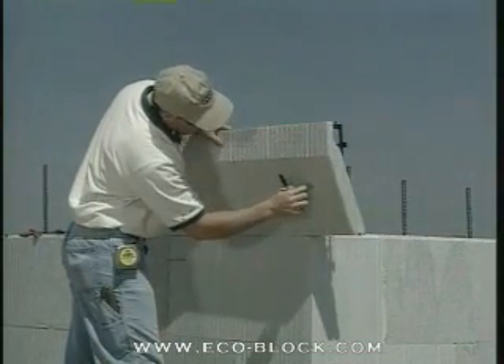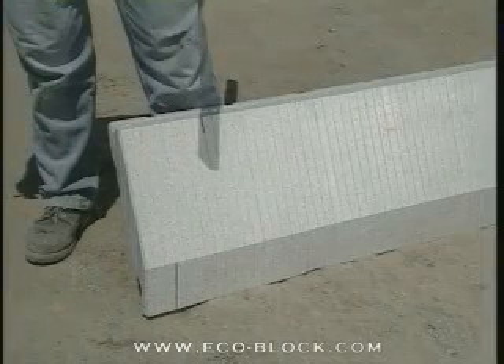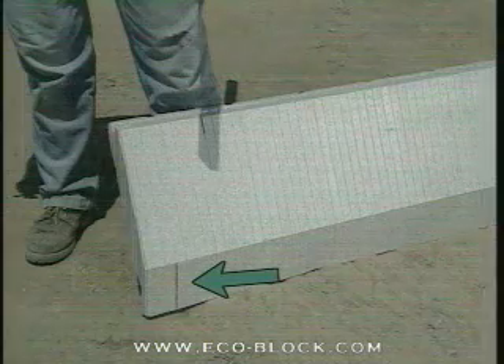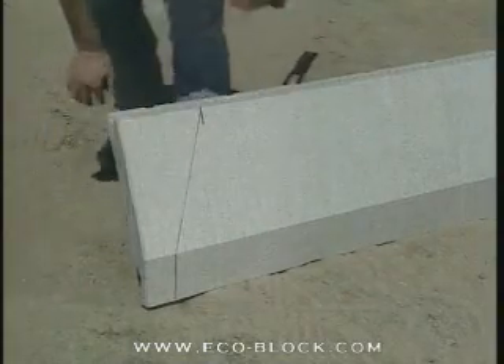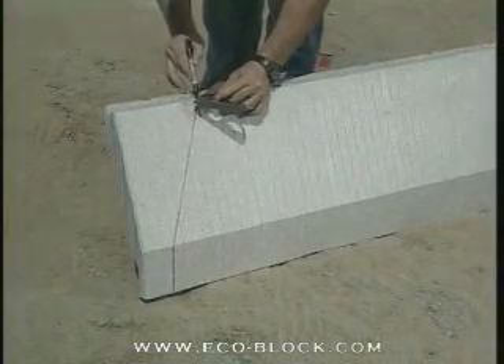Count over five inches and mark the top edge of the panel for the top of the miter cut. Draw out the cut on the face of the panel. Extend the mark you made on the top edge straight down the flat face of the panel, making that part of the miter cut vertical. Connect the end of that line to the mark on the bottom of the panel. Using a tri-square, mark the bottom edge for the 45-degree angle.